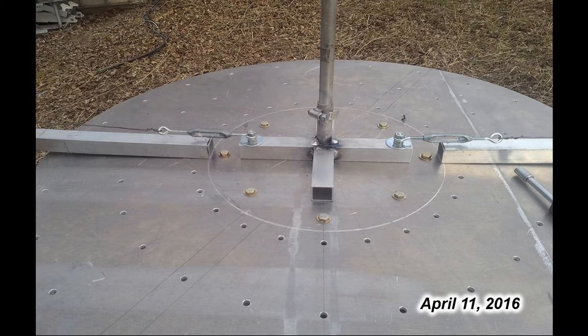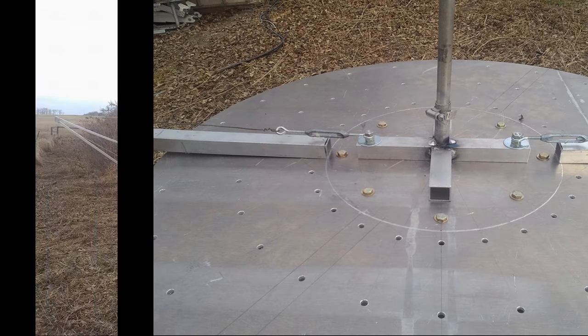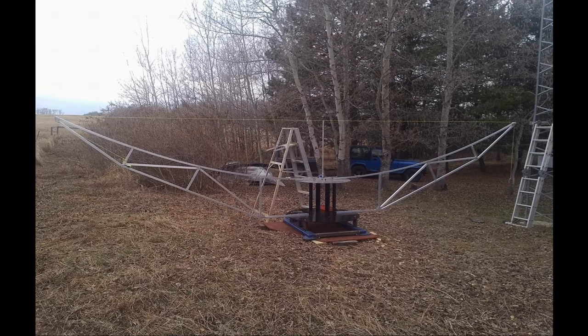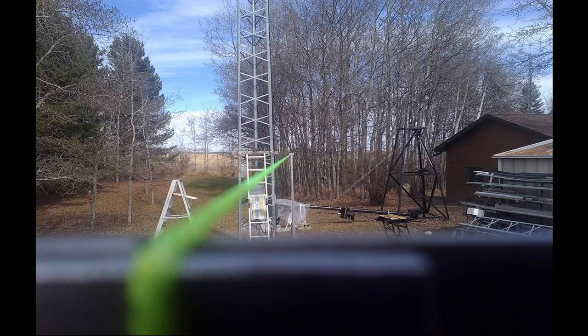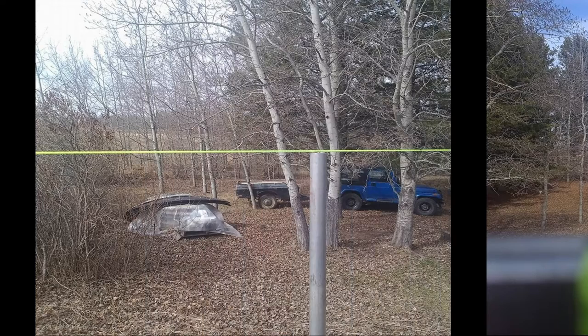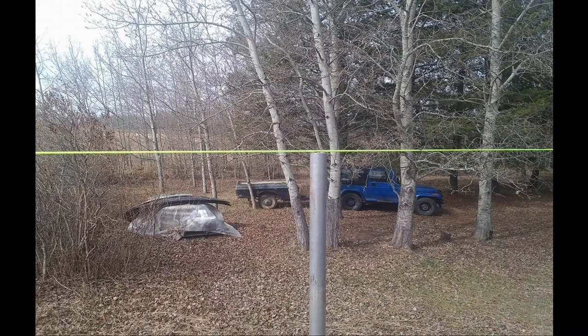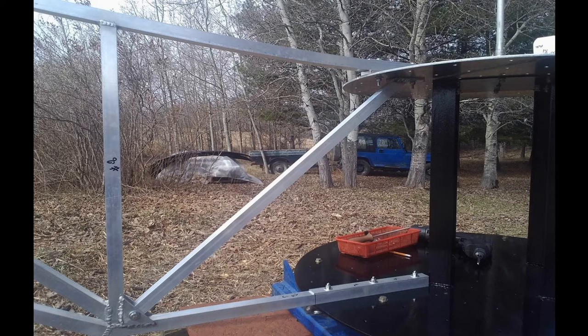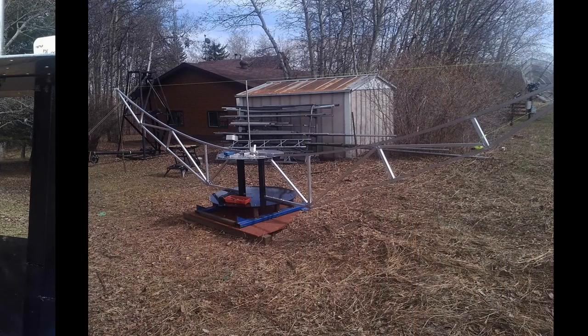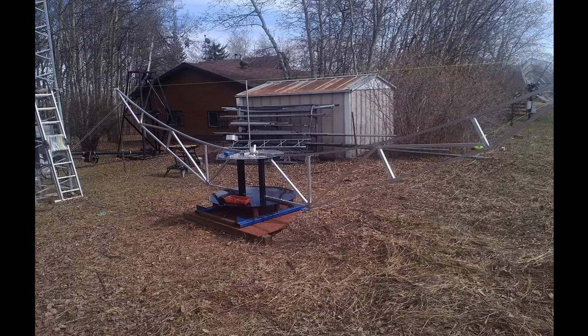The lower rib leg was bolted to the steel plate but the top tubing was just slid over the aluminum plate and held in location with two turnbuckles. A center vertical pipe on a stand is located on a hole in the middle of the aluminum plate — this vertical pipe is what's measuring the depth of the dish. A string is pulled tight from the edge of one rib to the far rib. I adjust the turnbuckles back and forth to first get them centered and then adjust it so that the vertical pipe for the depth is just touching the string in the middle. Once the two ribs are perfectly centered and the depth is correct, an extra crossmember is built and placed from a truss gusseting point up to underneath the top aluminum plate of the hub, which makes the whole assembly super strong.